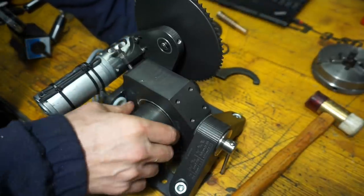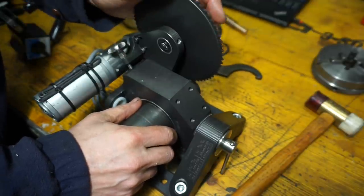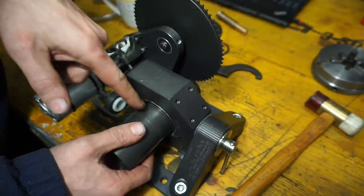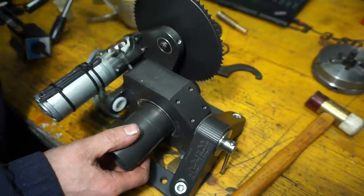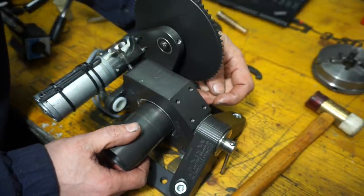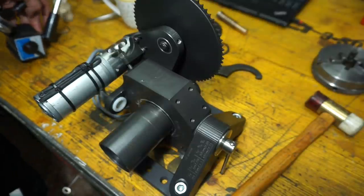The snugging feels very nice and very quick. A gradual snugging would be a problem because this would suggest a runout problem here at the shoulder or at the spacer bushing or at the nut in the back here, but no indications of this whatsoever.